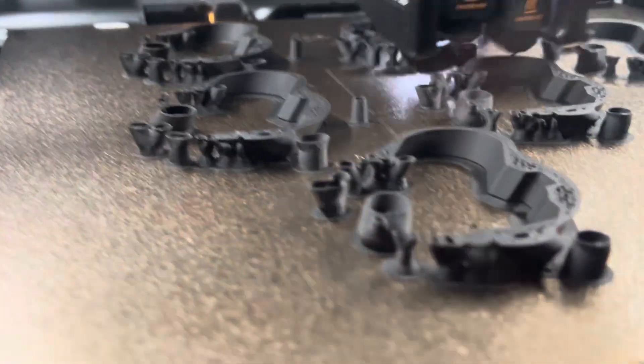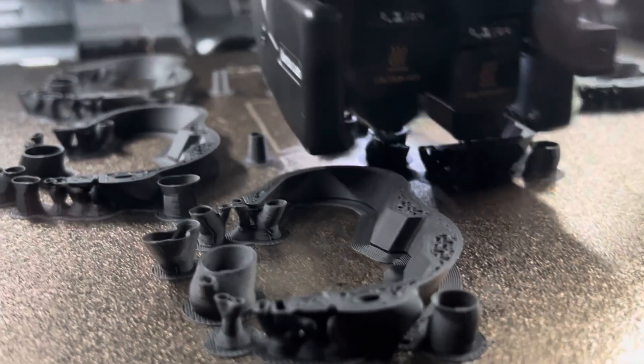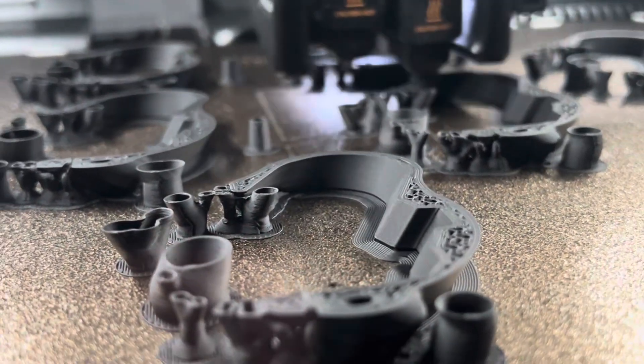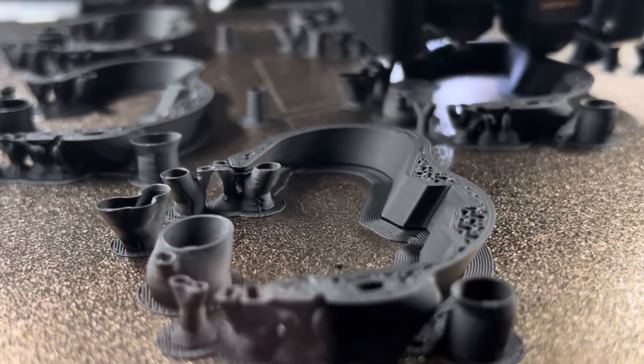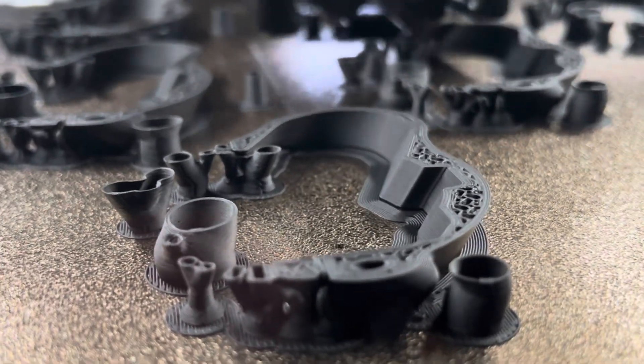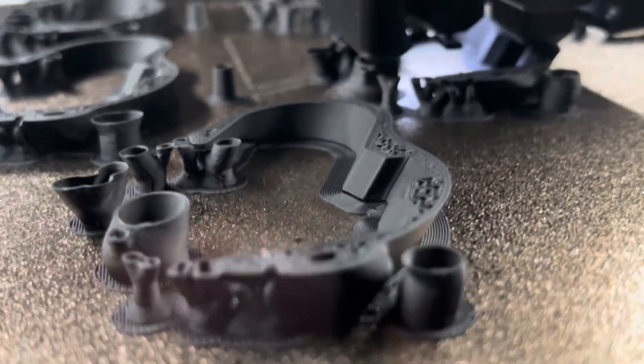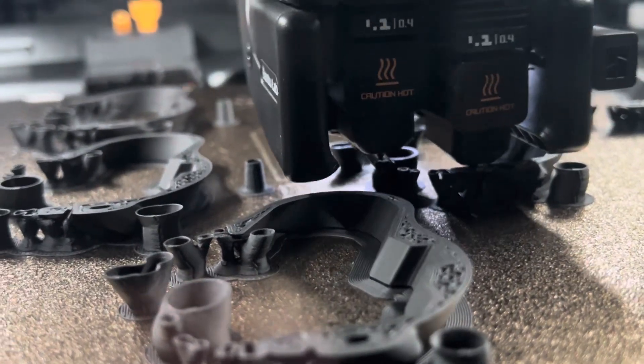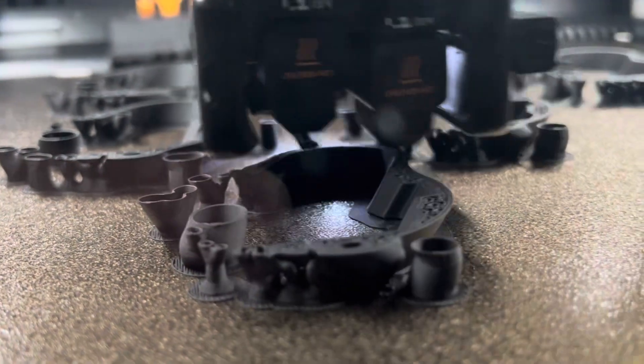The flow default was set to 0.995. I changed the flow from 0.995 to 1.0, and a few other details like that. I also raised the extruder temperature from 265 to 268 degrees — so just three degrees — and I don't have that much experience tweaking these settings.